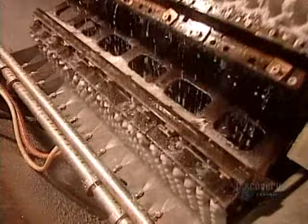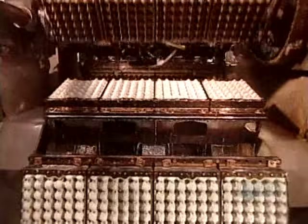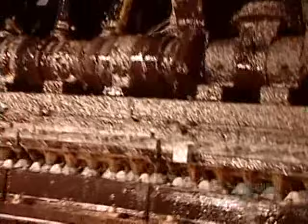The pulp exits out the bottom of the pulper through a filter that screens out plastics and other contaminants. Shaping the flats is a fully automated process. Formation molds descend into a vat filled with pulp, a vacuum sucks the mushy mixture onto them, water jets rinse off the excess, and rotating transfer molds above grab the flats and move them onto a conveyor.